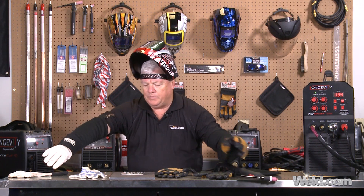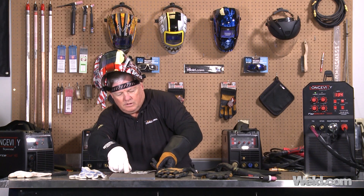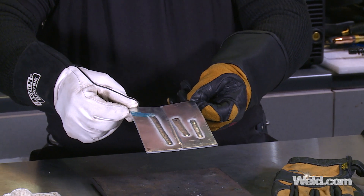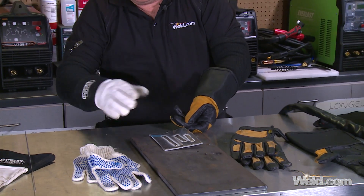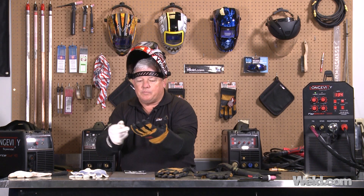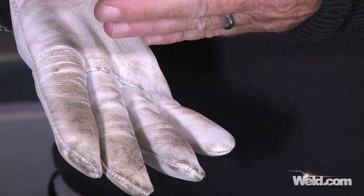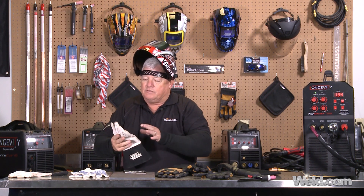Okay, so now this plate's getting pretty warmed up. I'm going to grab these two fingers right here — and you can see that's just not a problem. You can see where that plastic was on the cheap gloves, smelling and burning. Just stay away from anything that's got rubber or plastic on your glove. These are the heaviest duty because of all the different overlays and overlaps. The thin leather held up pretty good, but you can see burn marks and the finger is starting to shrink up. As you get more burn marks, that finger will shrink up more — that's really what causes the longevity issues with that type of glove. I do an awful lot of light welding, so gloves last me a long, long time.